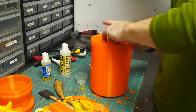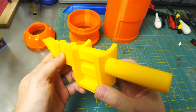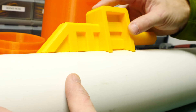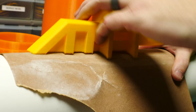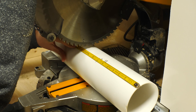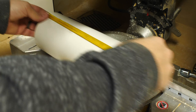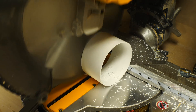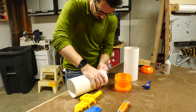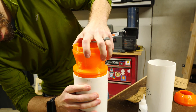A whole lot of these pieces were just big cylinders, but they did have to have some support material in them for certain little details. Some of the pieces were modeled to fit on the PVC pipe, but that surface where there was support material was really rough. So I put some sandpaper on the PVC and sanded off the underside. I cut down two sections of PVC to match some of the cylinders in the model, using the four-inch pipe as my guide for the sizing. To put these pieces together, I cleaned off the burrs on the ends, and then after doing some test fits, I used some super glue to attach them.